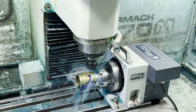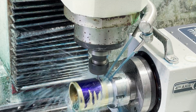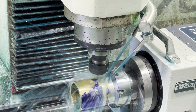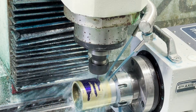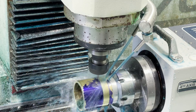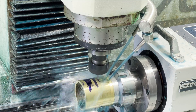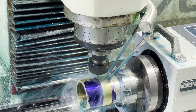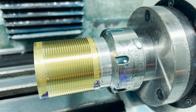Now come down and do the cutting. I did this in three passes — it's a total of only eight and a half thou. That bit is spinning at ten thousand RPM. It's a bullnose, one-eighth inch, three-fluted bit. First I came down five thou, then eight thou, and then a half a thou finishing cut. This is sped up. I use that dye to make sure it's blanking out edge to edge. You can see there's still a little bit of blue in between — that's because that was only a five-thou cut. With all the cuts, you can see it comes out clean with a nice finish.